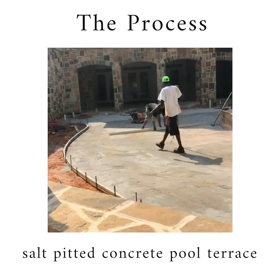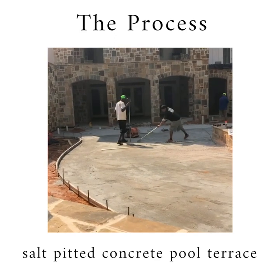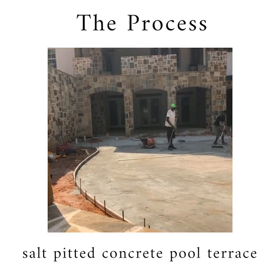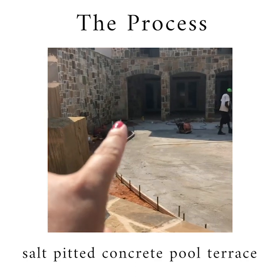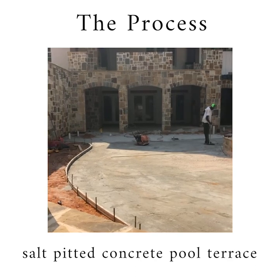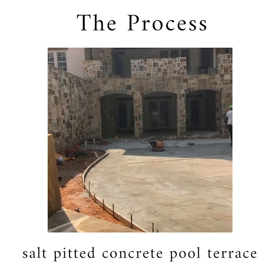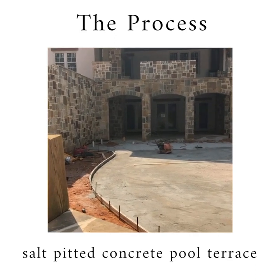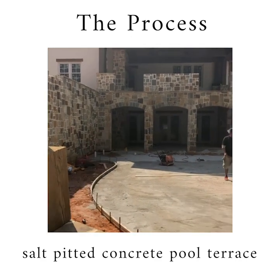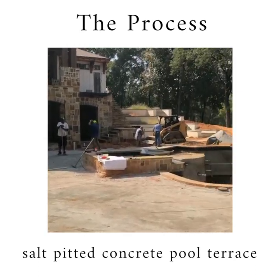So on our end, we want to make sure that we have drain boxes set in the correct place, but also just another quick thing to consider. I always like to have drain boxes underneath containers. So we're going to have a container there, and we're going to have another container over there, so that way you don't have a bunch of water going all over the concrete. You know how it forms that moldy look and it looks gross, and I just can't stand it. So we make sure that we put drain boxes underneath every container, so that way the water has a place to go and everything stays nice and neat and clean.